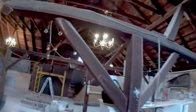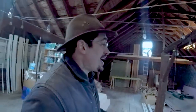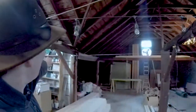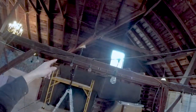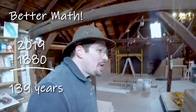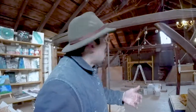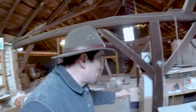It's an 1880s build — same time frame as the main house. We do have a little bit of a structural issue with one of the jack rafters that's cracked. In buildings of this age they tend to bow out, so we've got an aircraft cable that's drawn the two walls back together. At the same time we're pushing up on that jack rafter, just trying to take some weight off it. Over 135 years there's been some sagging and ballooning, but when we moved in, a thorough inspection determined it was not an immediate worry.